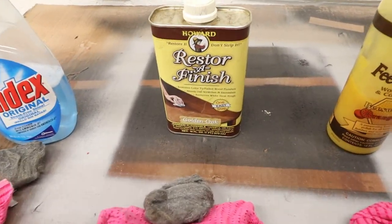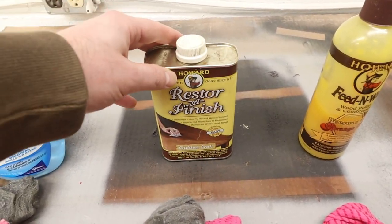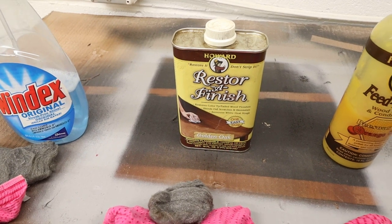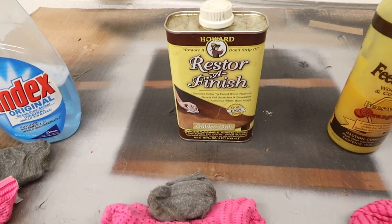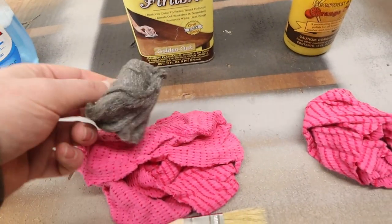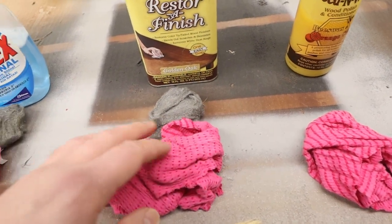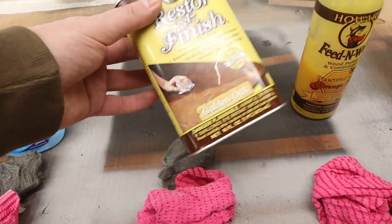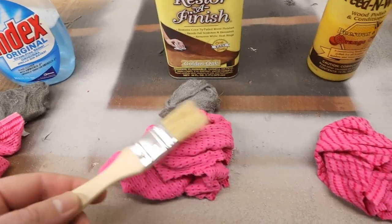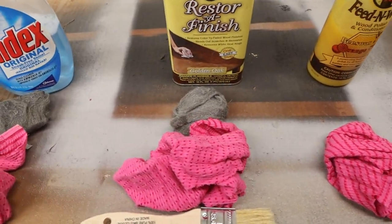Then the next step - I like this product. I've been using it for years and years and I've seen furniture I cleaned up years later still looking exactly like it did the day after I did it. So I can tell you that product does work and it does last. I just wipe it on with the grain with a little bit of 4-0 steel wool, then let it sit a little bit. This is made up of basically stain and solvents that eat into the existing finish to just revive it. Then I'll use a little brush to work it into any cracks or crevices or any kind of detail carving.